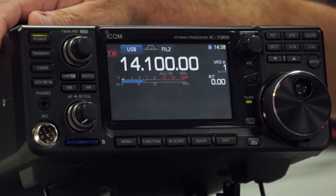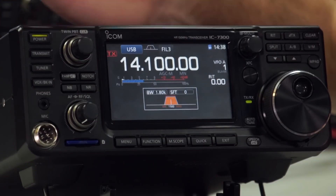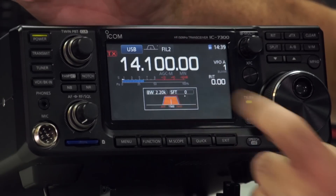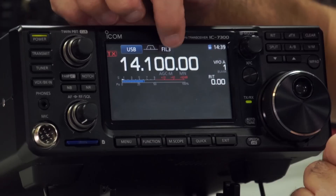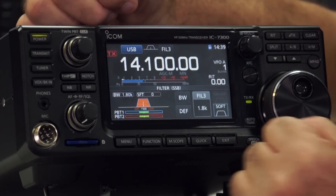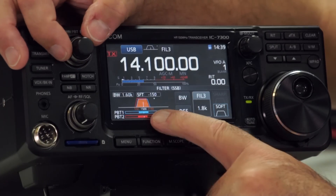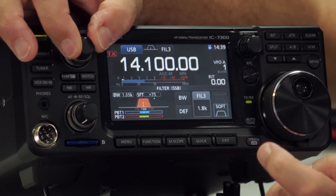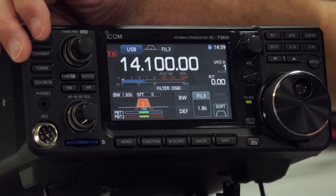We've got the receive filtering. If you touch the filter button, it comes up briefly and you can see the bandwidth is 3 kHz for Filter 1, 2.2 kHz for Filter 2, and 1.8 kHz for Filter 3. If you want to change those, just press and hold it and you get the full filtering menu. You can change the actual upper bandwidth and lower bandwidth. There are a couple of slider bars at the bottom — when they go green those are the default settings. You can also press the default button to take you back. You can also change the bandwidth by adjusting the main VFO knob.